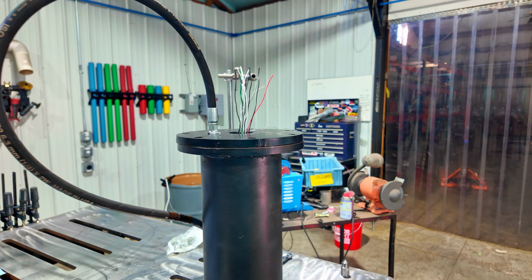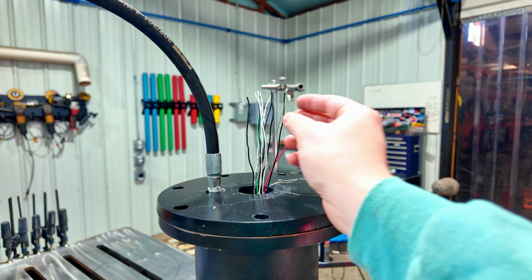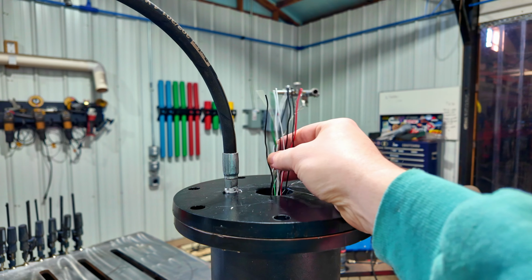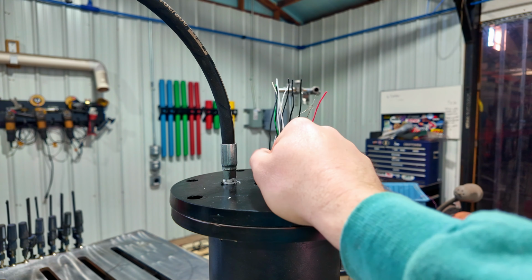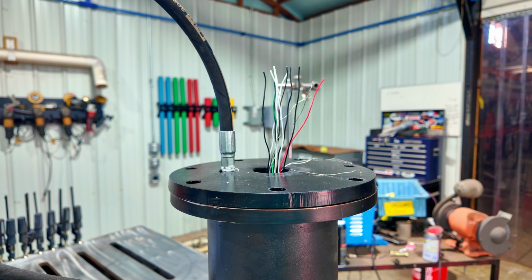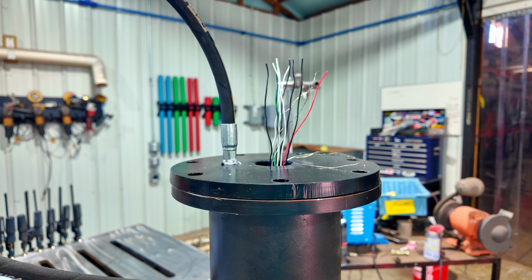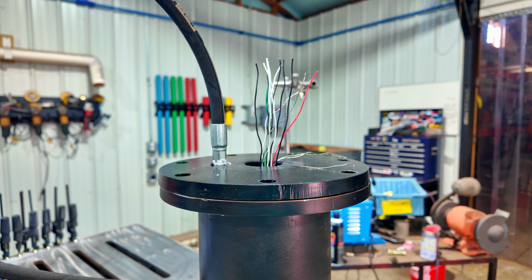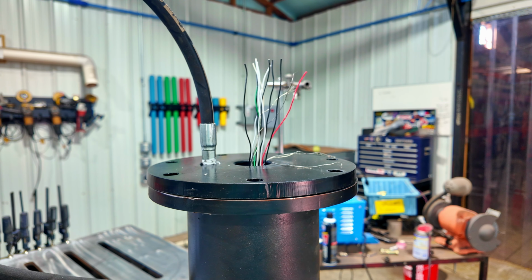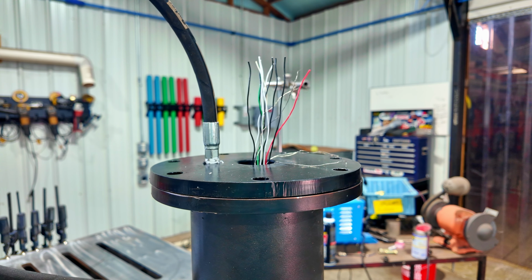Now, it's not as simple as making sure that it doesn't leak past the main wire. The water can actually get into the strands of the wire and travel through. So we've done a special process called window stripping inside the epoxy, and we're going to test that out. We've also had some other epoxy tests, trying different epoxies, where the epoxy actually just extruded itself out of the feed through. So we've done some roughening techniques and worked with an epoxy manufacturer to get something that we think is going to work really well here.